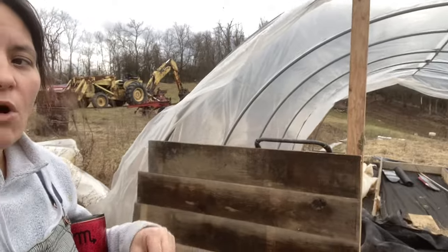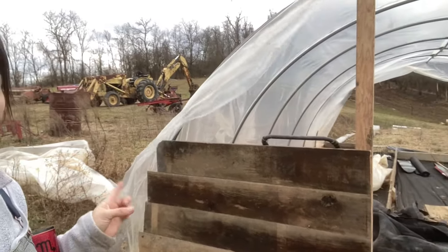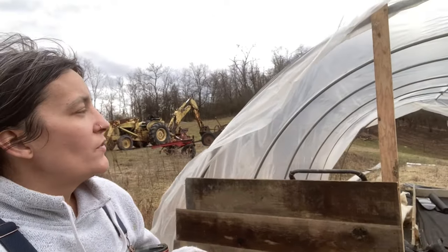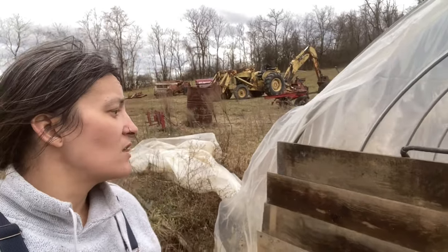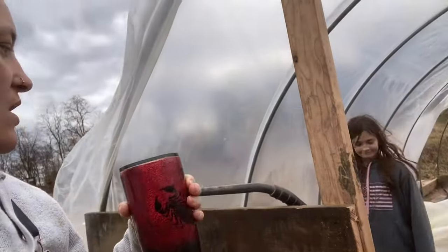I need to get dimensional lumber — treated lumber — a couple two-by-fours. I'm going to frame those out and make dutch doors, and I'm just going to cover them with plastic as well, so that allows maximum sunlight in. With dutch doors I can leave the bottom closed and open the top in the summer. The back wall will look identical to the front wall, and I'll take a sawzall and cut these edges off and make them round. I need a longer self-tapper to get this two-by-four up to the frame, but it's pretty solid.